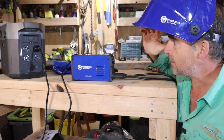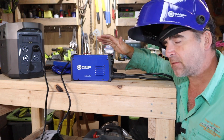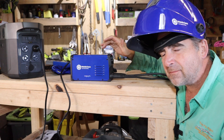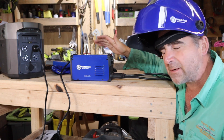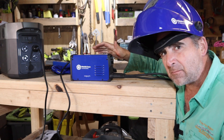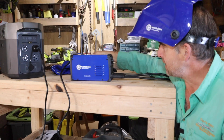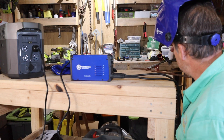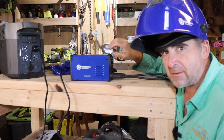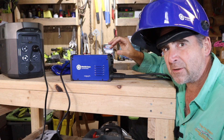I'm being slightly ridiculous here — I am starting out trying a brand new welder off a battery. Not off mains, not off a generator, but straight off the battery. I've had a lot of questions about whether there's a welder you can run off a battery. It kind of makes sense that you'd think a small welder might run off a battery, but this is not a small welder in terms of power — it's small in physical size. So it's all about amps. I'm going to start off running this welder on 60 amps. The sticks I'm using are recommended between 50 and 90 amps, so I'm going 10 amps above their recommended minimum. I'll use this on some rusty old checker plate set up on the corner of the bench and we'll see if it'll run off the EcoFlow Max battery. I'm pretty impressed with this battery, but it is just a battery — let's see if the two of them can work together and provide an off-grid solution.